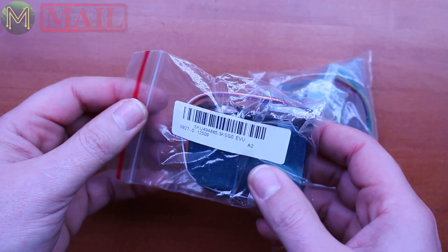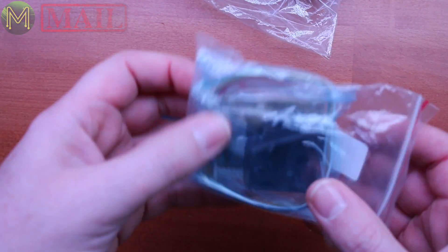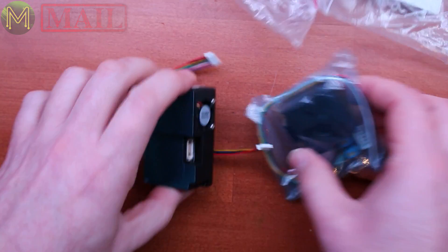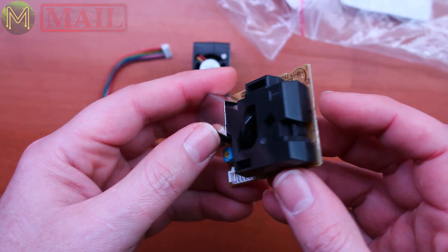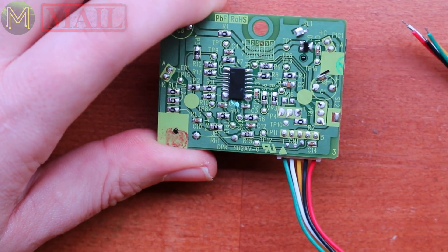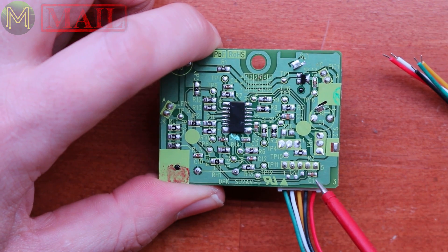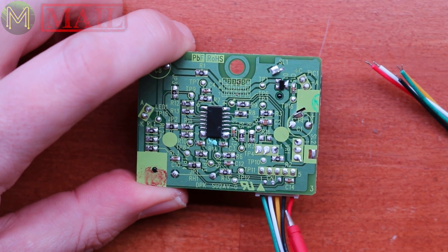Another one from a very old MicMakeMail segment — number 2 I think — are these dust sensors. I've got two modules: one is a cheaper LED-based dust sensor, and a more expensive laser-based module. The laser module has a fan to pull dust in; the cheaper version has just a plain LED with no fan. The problem with this PCB is that it's so old — there are no schematics, no information online, and the only information available has different colors and different pin-outs for these connectors. To avoid making the same mistake as I did with the touch sensor, I need to properly figure out these connections.